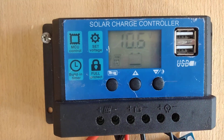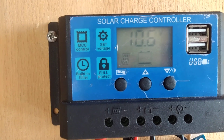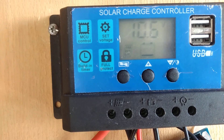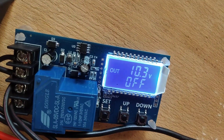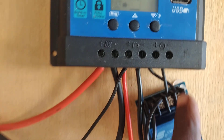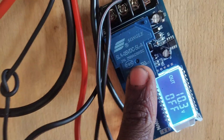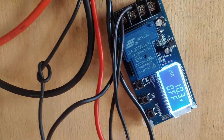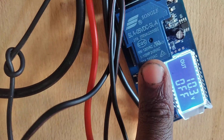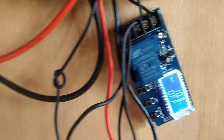It's a cheap charge controller, but I really recommend a proper higher-quality charge controller for starters this is good. I also have a battery charging module here. I use it off my load, but it's better to use it off a solar panel — it's basically like a charge controller for solar or any different type of generator. It's 30 amps maximum and 8 volts to 60 volts maximum.